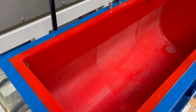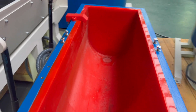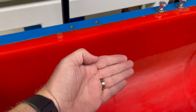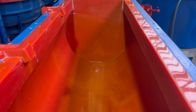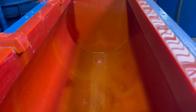There is a consideration on this: this is a side type that you'll see most of, in so much as it's a U-shaped section, and the leading edge of large pieces can tend to get chatter marks as the media gets stuck between the part and the side wall. So if that's an issue, then we look at a machine with a double curve on it, as this one has. You can see there it's a different shape that tends to eliminate those sorts of problems.